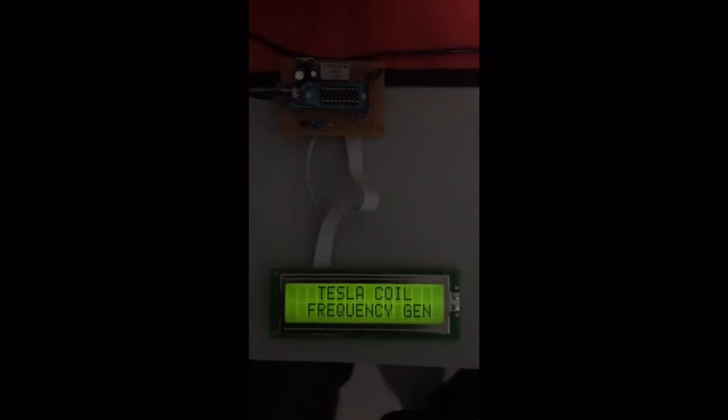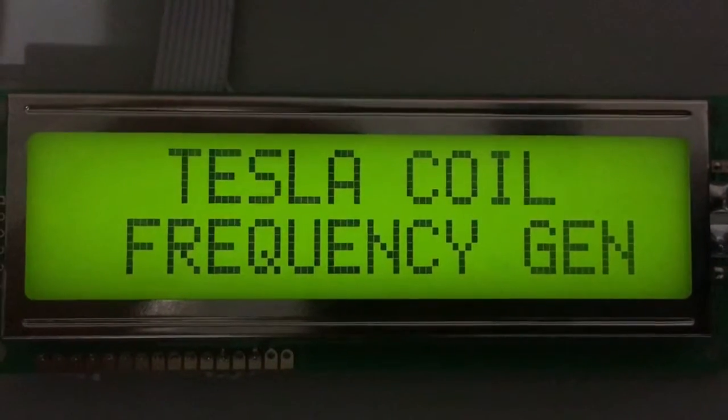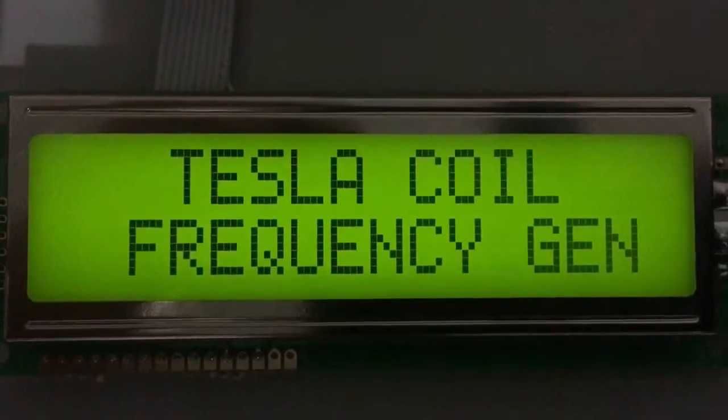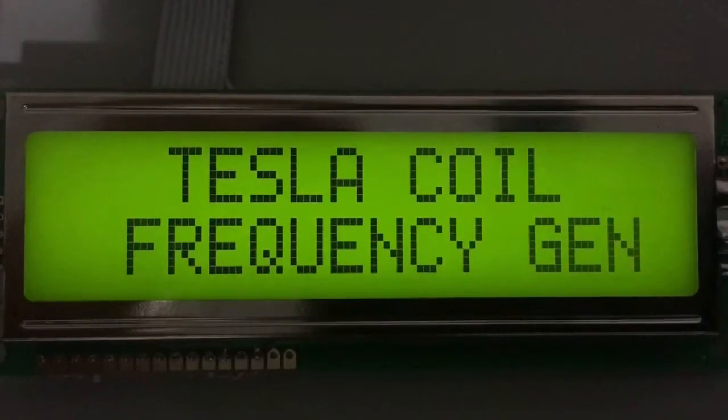I've got an LCD connected up here now and the LED you can see is actually sweeping — and BAM, did you see that? Software controlled backlight. And furthermore, software controlled LCD contrast. So that'll provide a lot of nice effects. I can fade in a title and add transition effects to that later on. It can also make it go a lot faster, so that should be interesting. It's the first time I've done that, and it's achieved simply by connecting the LCD contrast to a hardware PWM pin.